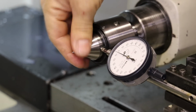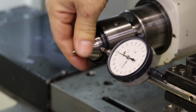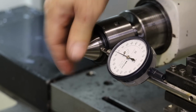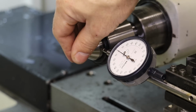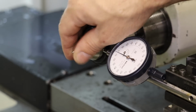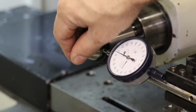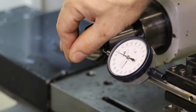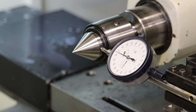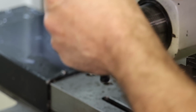without adding error from the bearing getting too hot and things like that. So I'm going to spin the bearing, and we've got a 1 micron runout, so that's about 1/2 tenth. And then if I'm pushing and pulling, I don't know, maybe 5-6 pounds, we're getting 2 or 3 microns, or 1/10 play in this bearing. So I can continue to do this.